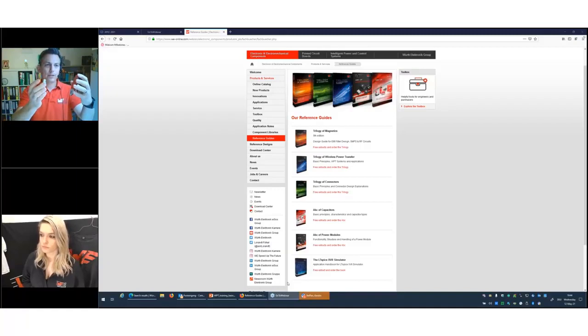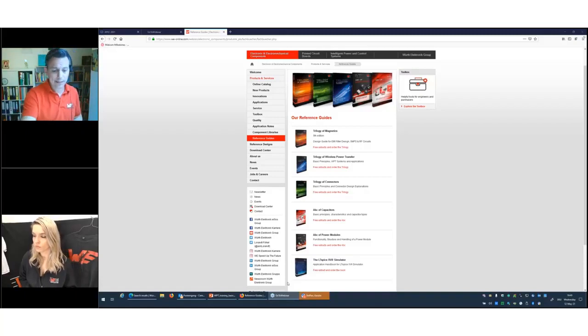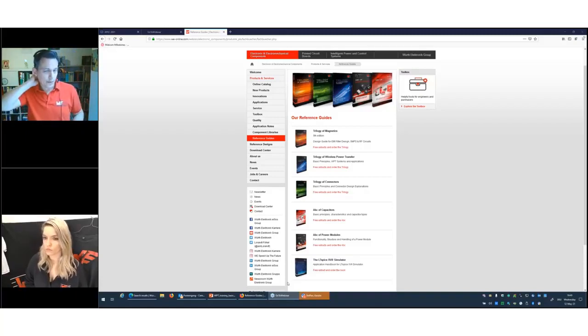But in general, it's always very hard if you have a huge distance. The stray fields are big, and then it's getting much harder for your FCC or RED or other EMI certifications. So in general, yes, it's possible, efficiency getting down, but we are not recommending this.